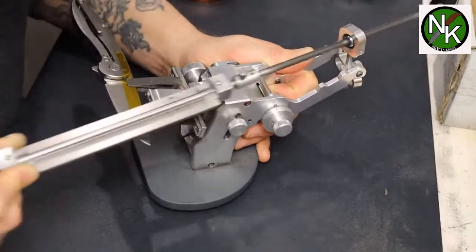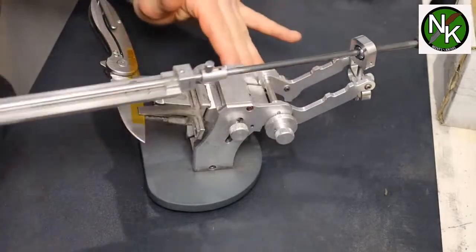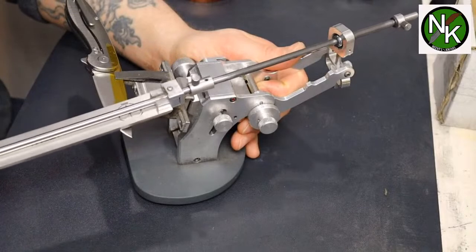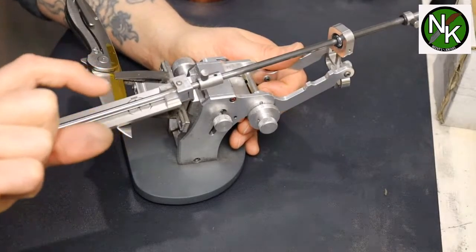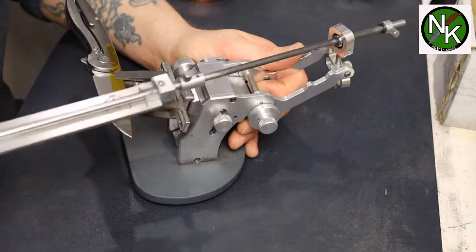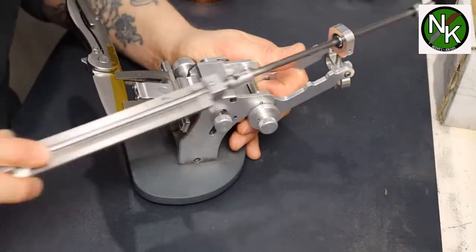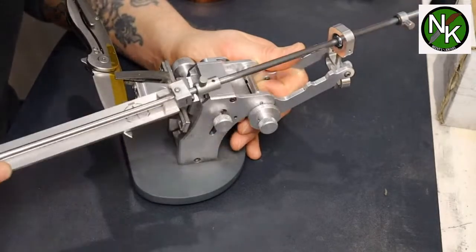I could do it from the eye. And then sometimes, you see what I'm doing right now? I'm doing single passes like this. But what I'm doing is once I get to a certain point, I'm lifting off. I'm applying pressure down very lightly. Once I get to that certain point, before I hit the middle, I lift off, lift off, lift off. So I'm just trying to get a little part of the tip without letting it roll over.